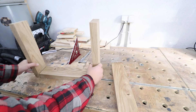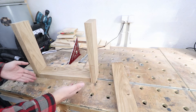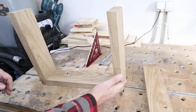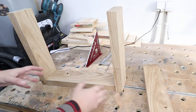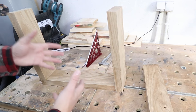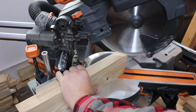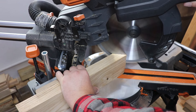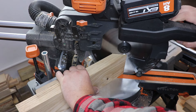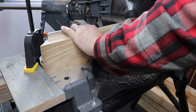For the next step we need to decide how we're going to construct our frame. You can just put the pieces against each other, use some wood glue, some screws, off you go. However, I think if we're going to do mitres at 45° around the perimeter, these will look really, really nice and give that extra fancy look to the whole thing. So let's head over to my mitre saw and cut 45-degree angles on all the pieces on both sides. I'm going to use a stop block to make sure every piece is at the same length.